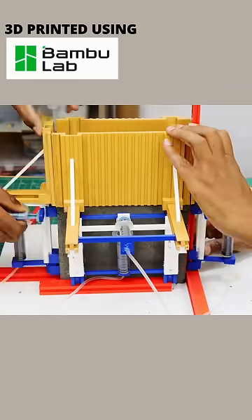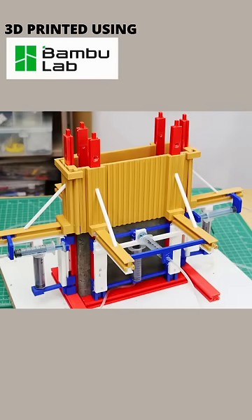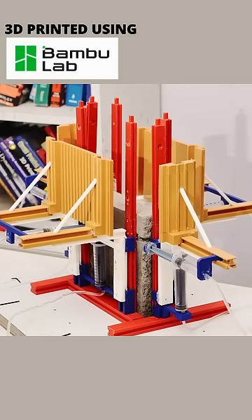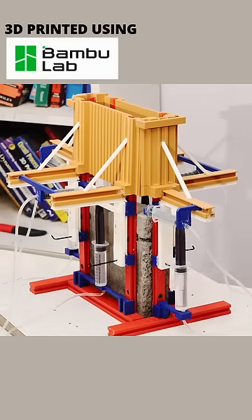Jumpform Technology starts with hardened concrete, which was made with the help of normal formwork. The system consists of three key components: formwork, tracks, and a hydraulic system. Two separate hydraulic systems play crucial roles in this process. The first system is responsible for detaching and reattaching the formwork, while the second system lifts the forms to the next level.